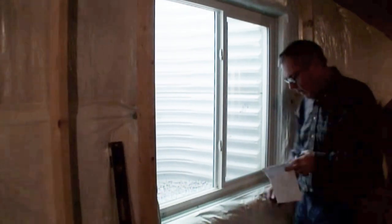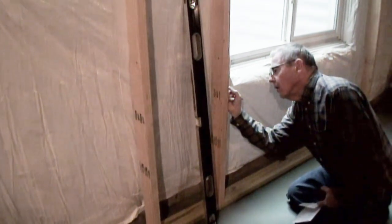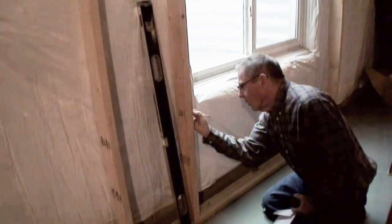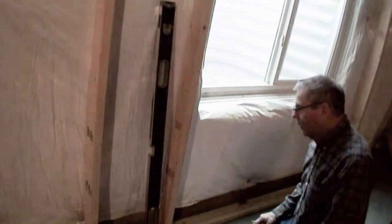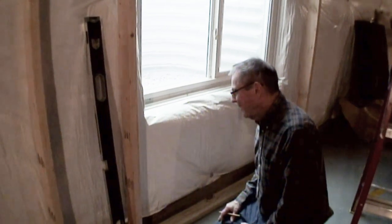So I need to end up a half an inch below that. He's accounting for the thickness of the sheetrock there when he says that. Half an inch of sheetrock. I'm going to have an inch and a half of stud. And don't forget, there will be sheetrock going on the whole outside of this, below the window, above the window, and then a piece of it going horizontal over to that window shelf that people would ultimately step on if they needed to get out. And that's what he's measuring and considering while I'm talking and disturbing his train of thought. Not so much.